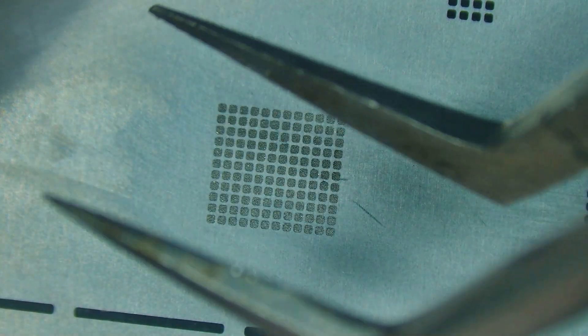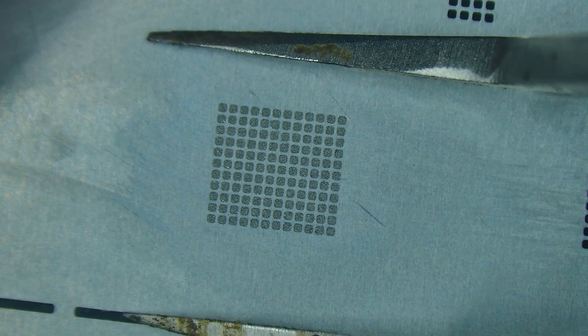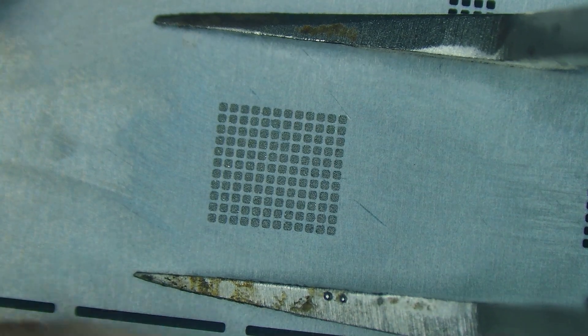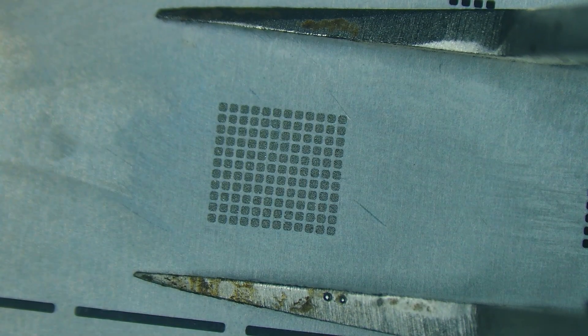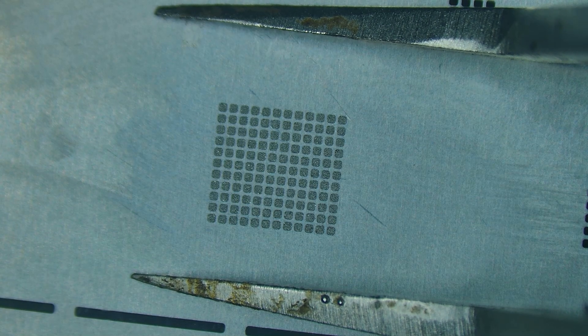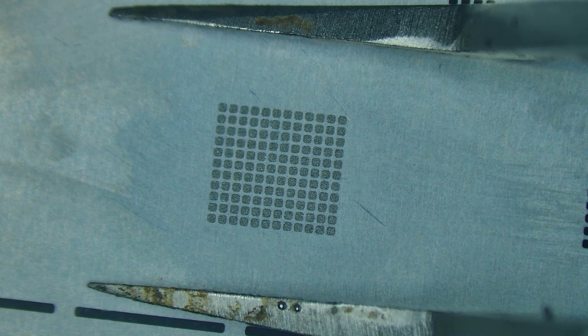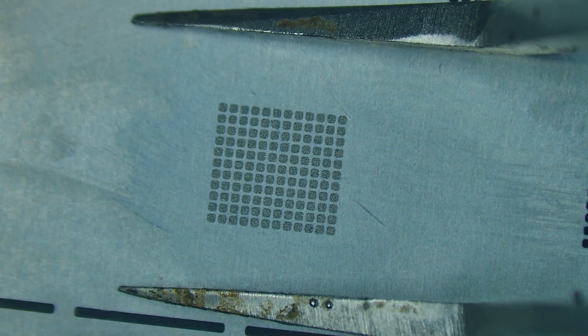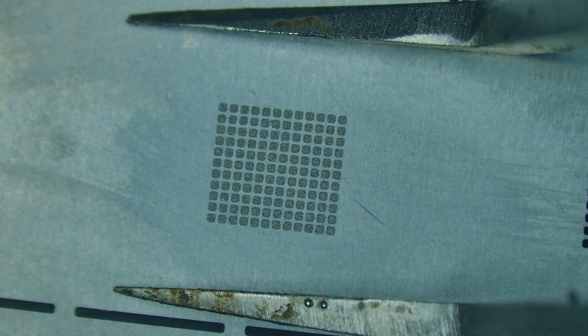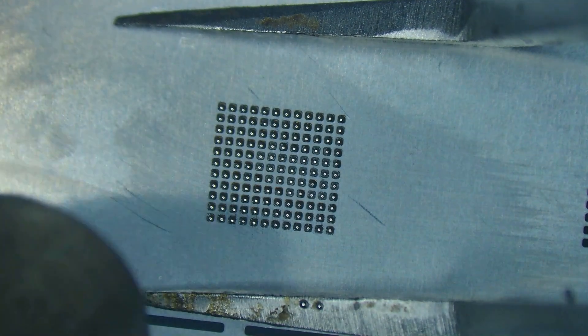I have a pair of tweezers with a flat side that allow me to give good compression on both sides, because as you heat up the stencil it will warp. I'll go ahead and turn on the rework station — got it set at 360 degrees. You don't have to go that hot but it's where I like it. We'll slowly warm up the area and start in one corner and move towards the other.